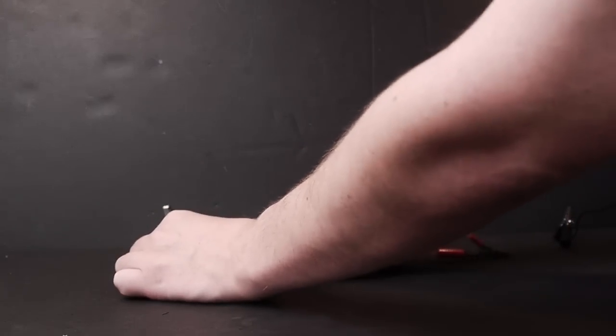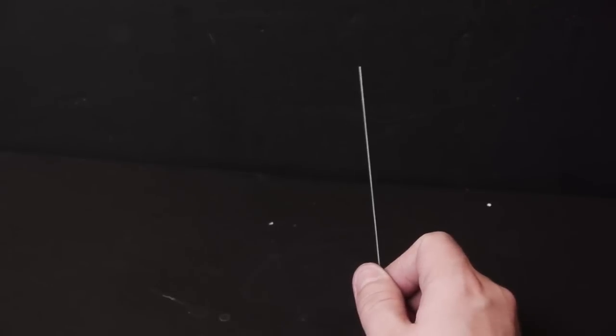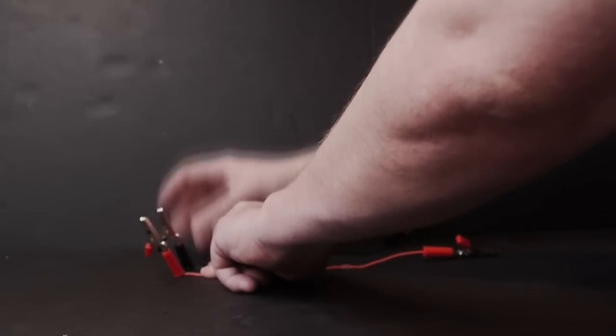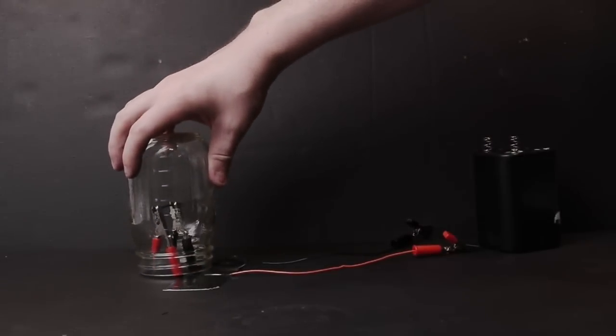I'm going to take you through my trials and hopefully cram a little knowledge into your brain in the process. I started off by hitting a local art store and I bought 2mm thick pencil lead. I then hooked a couple of copper wires to it and then a 6 volt battery. I put the result into a glass jar to help slow down the burning process — less oxygen.